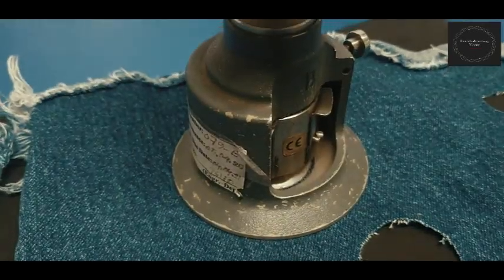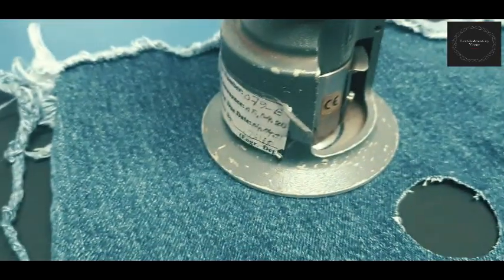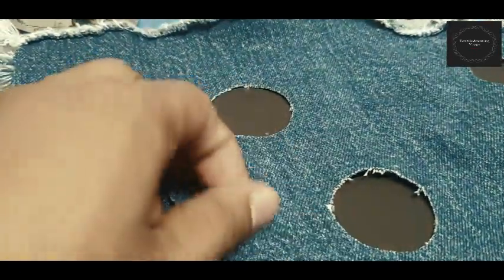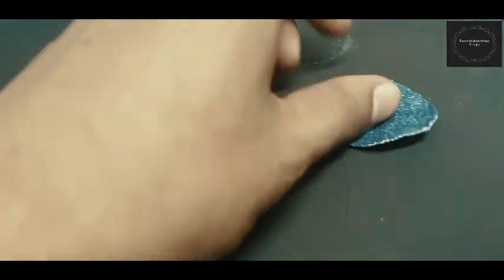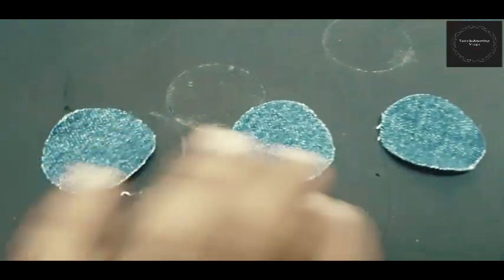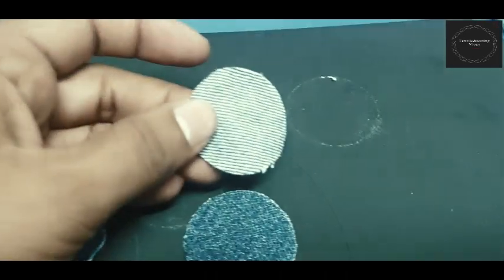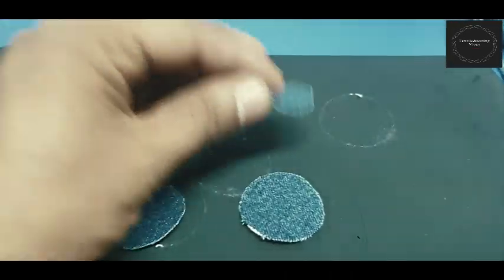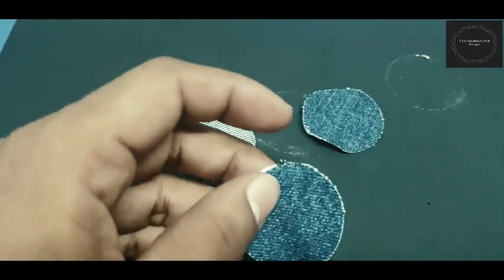For pile fabric or cut pile fabric when tested without backing, the equipment produces a footprint. Mount an interior piece of the sample having the appropriate diameter with the fabric facing upward on the abrasion table over the abrasion field. Secure and mount pieces of abrasion material of 38.5 mm diameter in the specimen holder. With the specimen holder, use a foam backing and a new piece of abrasion material for each specimen treatment.